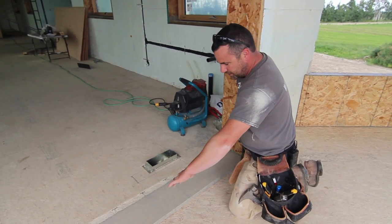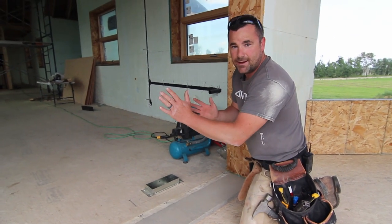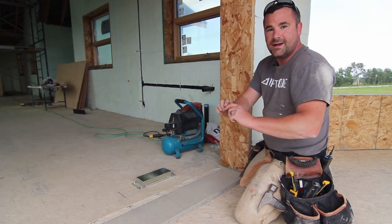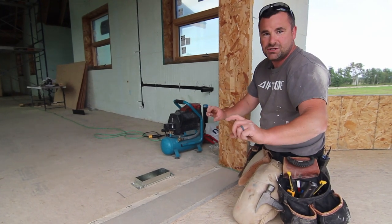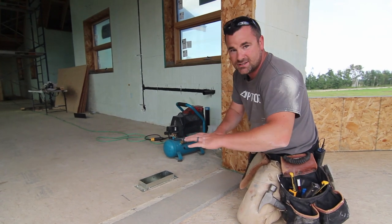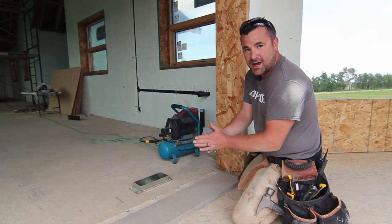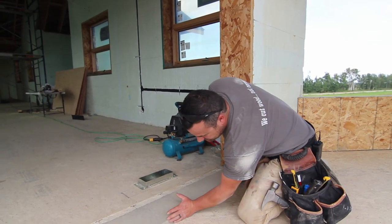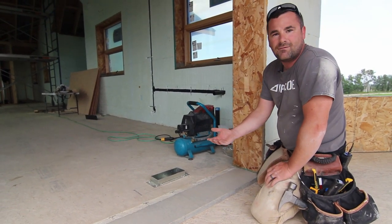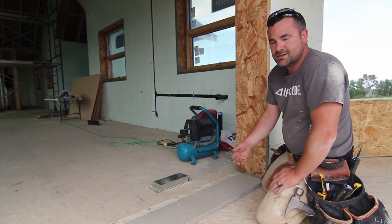When we put the door in, we'll silicone the living daylights out of it and slam the door in. With the new energy code, a lot of doors now have a bottom flange — before they never did. So water, especially in the winter, snow builds up and slowly melts and it'll just wick into the house. But now the new doors have a flange like a window, so the flange will sit up against there and we're protected against water. Plus it's a covered breezeway, so there'll be minimal snow or water in here, but it's good to think ahead.